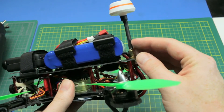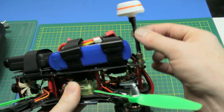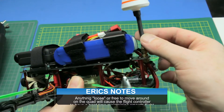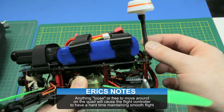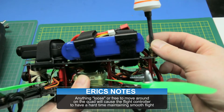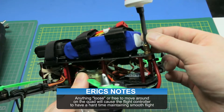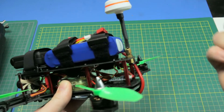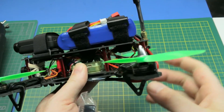Except I made a mistake — I left the antenna unsupported, and it was very floppy. What ended up happening is that was actually inducing an oscillation, and it was very hard to tune out. When I stiffened it up with just a piece of coffee stir stick and some heat shrink over it, problem solved — no more oscillation.